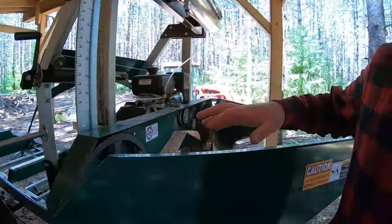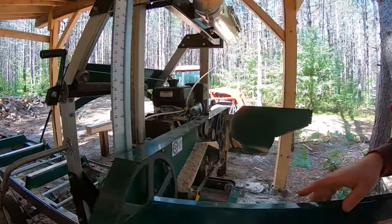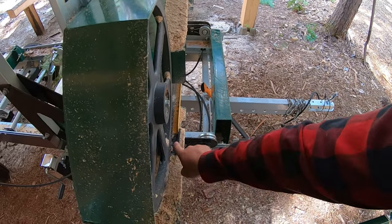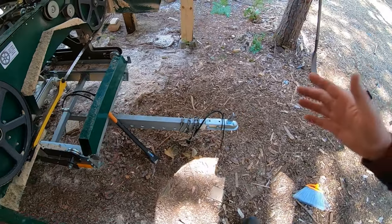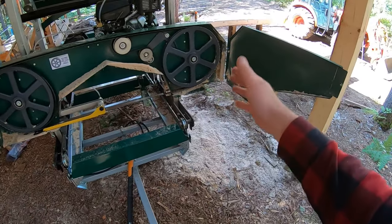The manual is going to talk about going very slowly with the follower band wheel tracking adjustments — I 100% agree. If you jump in and make a big adjustment you'll see a big change, but you might end up just fighting the tracking, moving it way forward, way back. Instead, make very slight adjustments, then stand over here and rotate the assembly. Watch that blade as it runs along the band wheel and look for very minute movements — that's what you're looking for. You're trying to get it back to where it tracks perfectly on both band wheels.